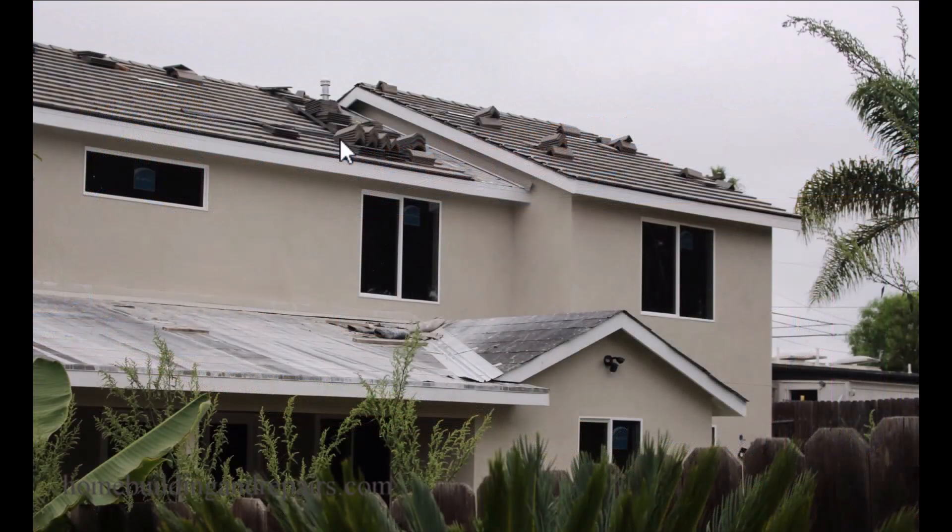Next up on the list: if you are going to load the roofs or install the roofing like they did here, make sure that you leave enough room for the plasterers to install the stucco or the carpenters to install the siding. Otherwise you could end up with a lot of ruined roofing materials — look at right here.